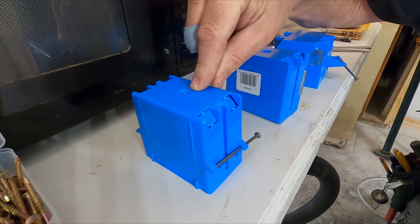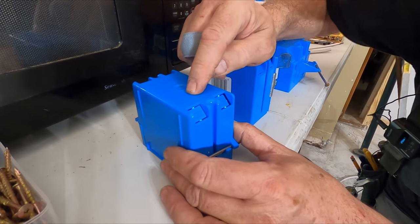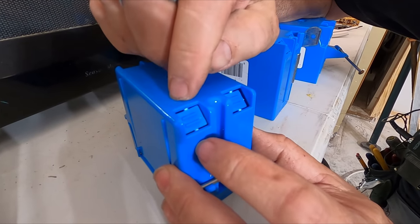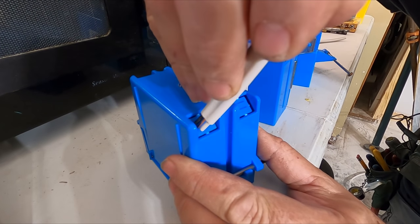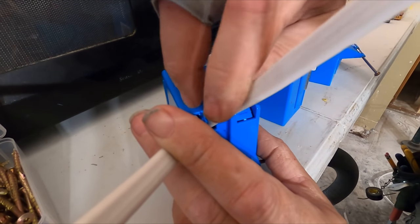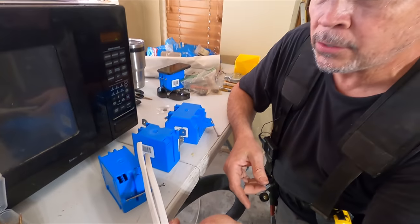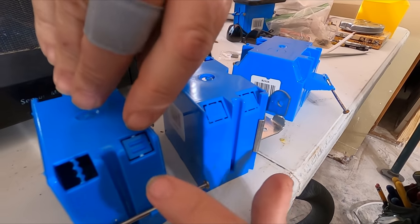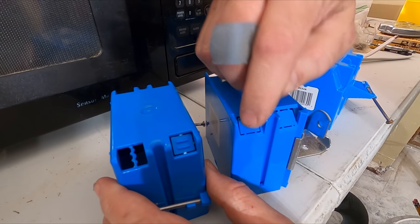This is the one you were all commenting about, the one we were installing. This is an adjustable depth box from Carlon, the kind we use for our backsplashes. And this is just a two-gang nail-on box. On this one, it's got this little — I'm going to call it a knockout, and you can call it a clamp if you want — but it's got these two ridges on either side, and it's attached to the box by two little pieces of plastic which allows it to hinge. You can push a piece of 14-2 Romex in one side and it does grab the wire. My problem is when you put another one in, it pivots to the middle and neither one is being anchored. Regardless of whether you call it a clamp or a knockout, you still have to staple within eight inches of the box, so it's kind of a moot point. The other box has kind of the same knockout, but this one is smooth — no ridges — and attached at four points, so that is obviously a knockout.